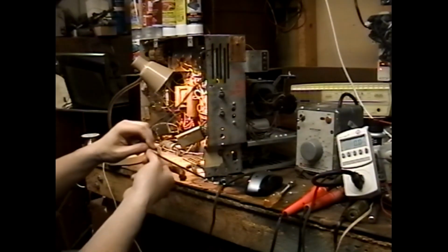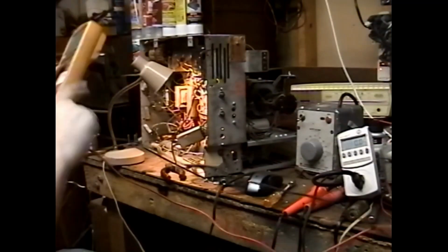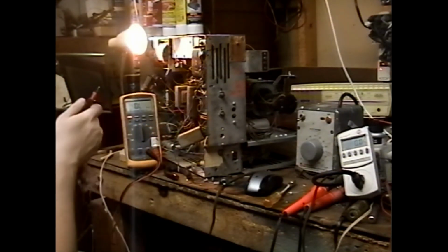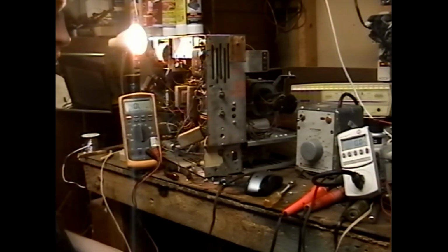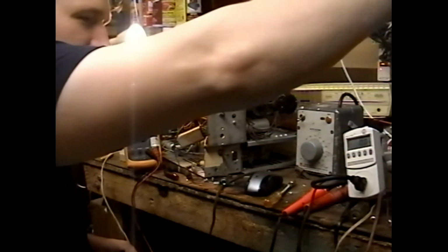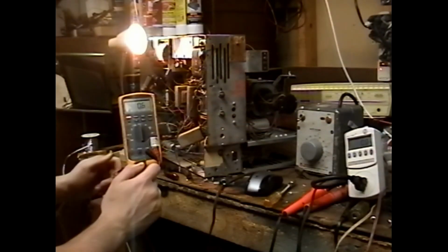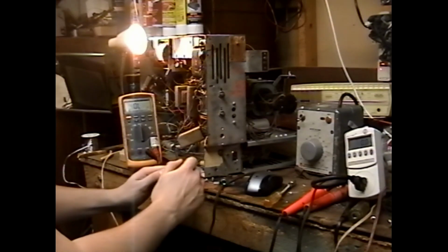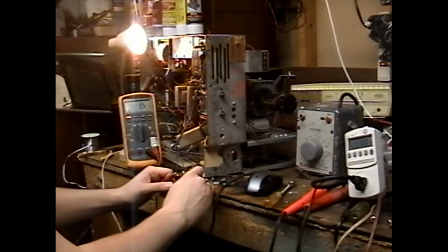let's grab our digital multimeter, set it to horseshoe mode. Let's have it tell us that our transformer is no longer usable. 0.6 ohms on the clip leads. That's okay. So the transformer has 0.9 ohms.